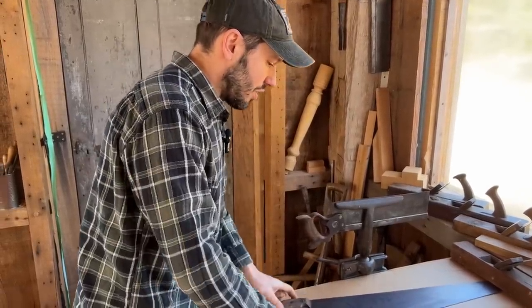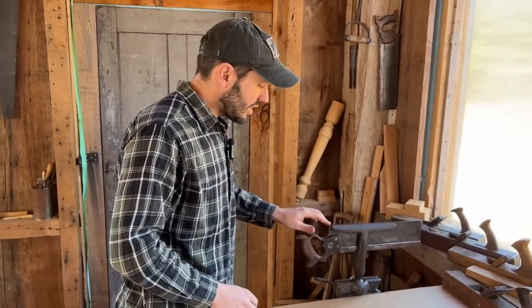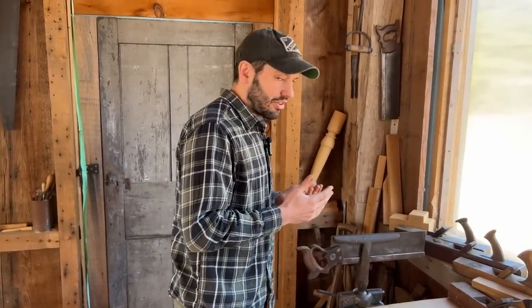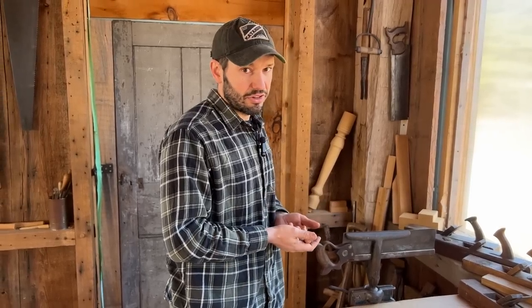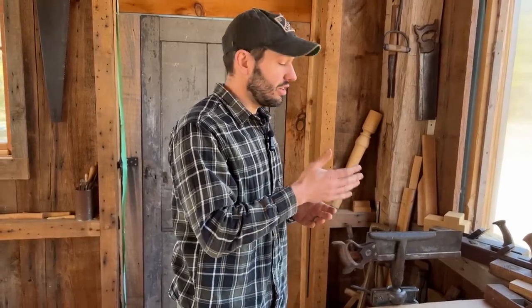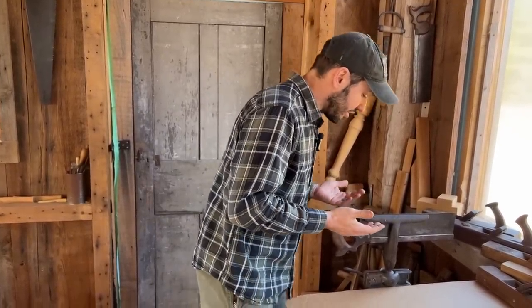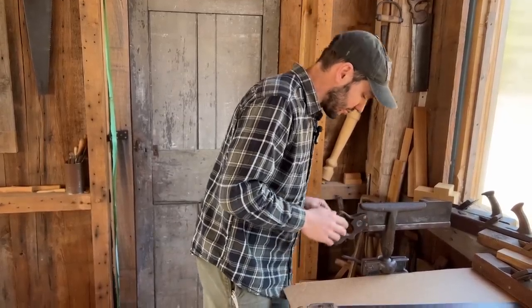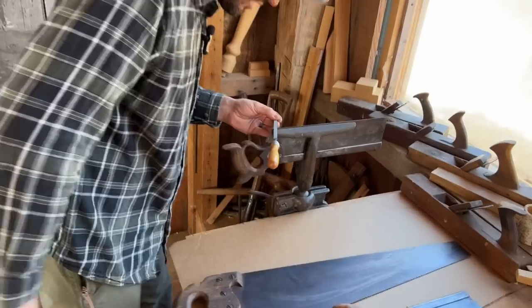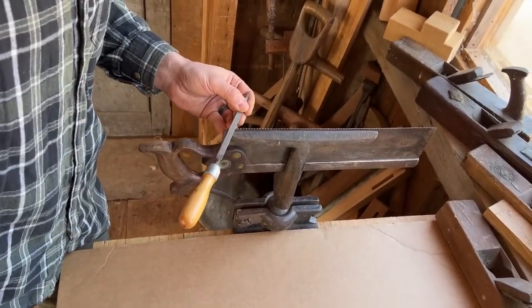As I mentioned, when you're sharpening crosscut, you have some fleam to consider. A crosscut saw, a back saw like this, often has something like 20 to maybe 30 degrees of fleam. If you're just doing a crosscut handsaw, it's probably 20 or less. But one of the best ways to determine the amount of fleam in the saw is just to eyeball it: find a tooth, lay your file in there and look at that and say, okay, this looks like 20 or 30 degrees.